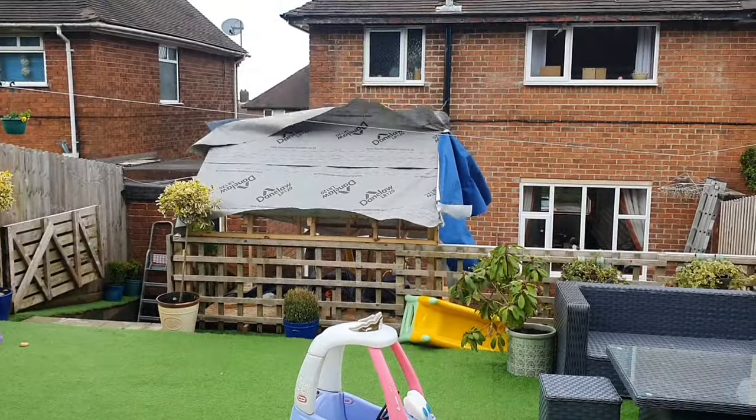The wind is blowing hard. The shingles for the roof are on the way and will be here within the hour. The rain has subsided, so I'm going to start getting this 18mil structural OSB on — I've got three pieces to put on. I'll whack it on now, and when the shingles come I'll get them straight on top so the roof is weathertight.